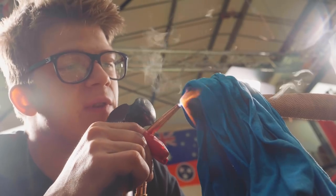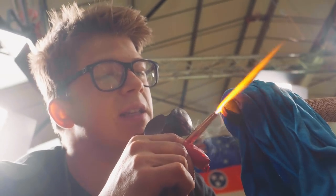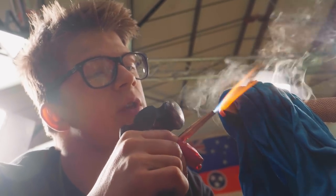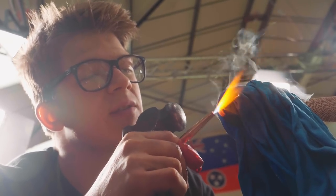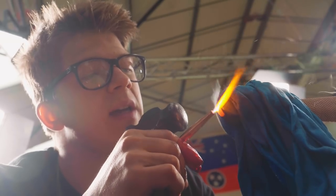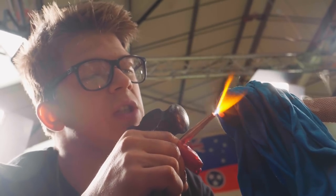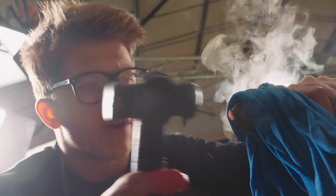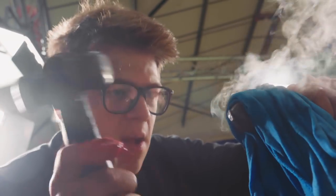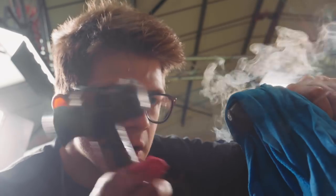This is a very tense moment because if I heat this up too much, I'm gonna burn the wood and destroy the nice fit up we have. So I have to heat just the tang, and I also have to make sure that I keep working it hot. Otherwise the tang is not gonna forge, and instead I'm gonna be vibrating the handle, making everything come loose. And there's very little time to do this because it will only move when it's hot.